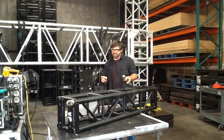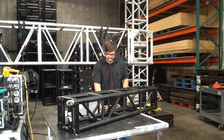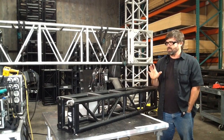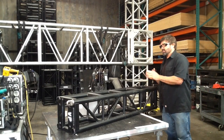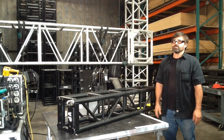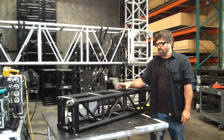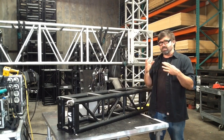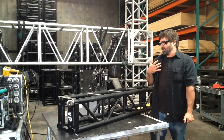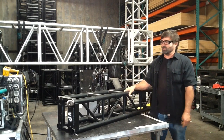When you get to your location and you're ready to assemble, the truss will all get laid out on the deck. As you're laying it out, it's a good opportunity to inspect the truss — just doing visual inspections. It is required that the truss gets inspected, but you're not the person who wants to take responsibility for it. If you see any dents, bends, abrasions, or cracks in the welds, those are the places it's going to fail — probably just take that truss out of service. Also, because it's aluminum, it's more delicate than steel, so you have to be nice to it. Don't drag it — it's going to make you look bad and it doesn't respect the owner's equipment.